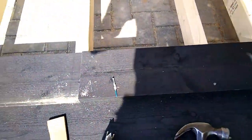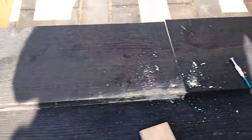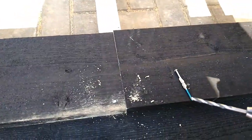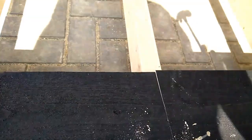One thing to think about when you're doing this cladding — this featheredge boarding — is that if you're using the nail gun, which I am, it's quite an unwieldy beast. When you're firing nails normally it's okay, but when you get to the end of the board, if you're not careful it can split them out. So what I do on the ends is I've got a 3mm drill bit and I drill each end and then just nail it up. That way you get a nice fixing and it doesn't split.